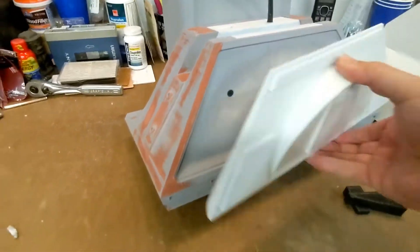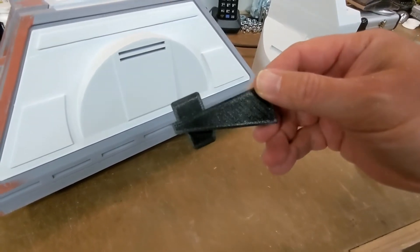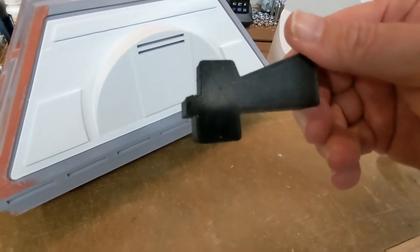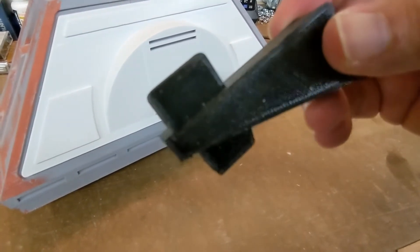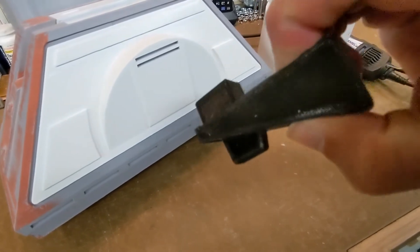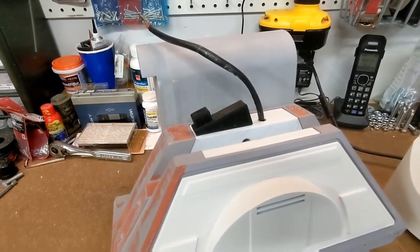The only thing that remains is the magnetic half moon piece that snaps into place there. You also have the ankle locks — if anyone's printing a Mark 3 drive, I think these are still located in the Mark 2 foot parts. These are probably some of the cleanest prints I've ever produced. When I first started printing flex I was pretty intimidated by it, but I've actually got my printer dialed in pretty well. This print right here is absolutely no post processing — right off the printer. I print these at about four perimeters and 20% infill, so they've got a bit of squish to them but they're fairly rigid. These will slot in right there and provide some cushion for the ankle.